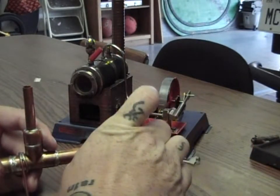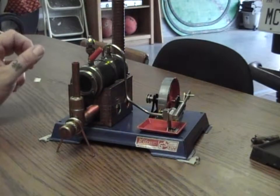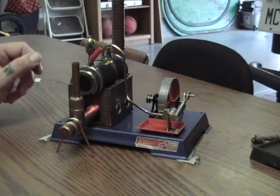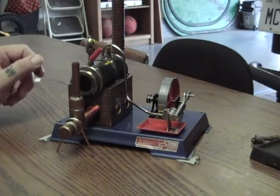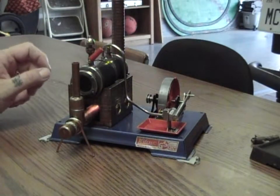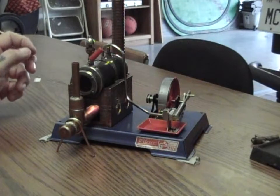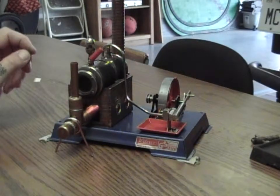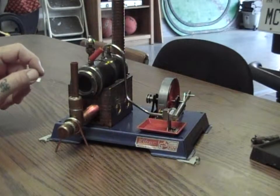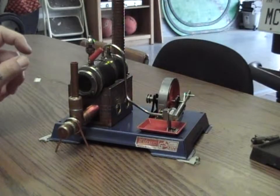In this case I've designed an oil burner that goes in there. You'll wait for pressure to start building up — you'll hear the water boiling inside. To check pressure periodically, just open the steam whistle and you'll be able to tell if there's pressure or not. From lighting until the engine is ready to use is usually three to five minutes, about five minutes for the engine to reach pressure.